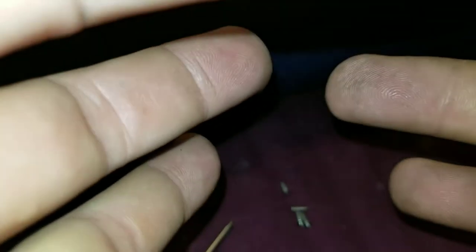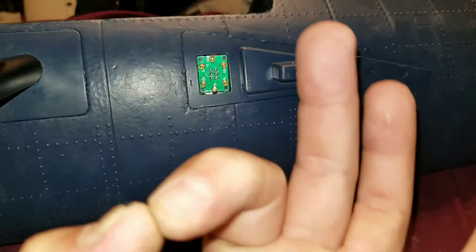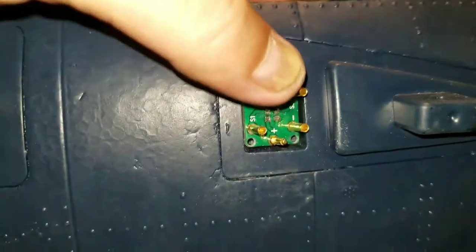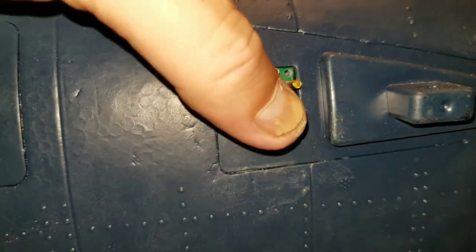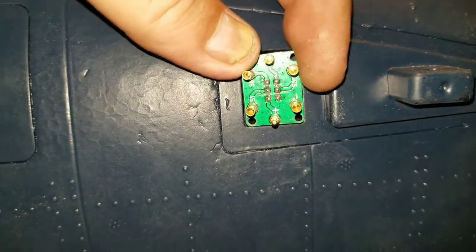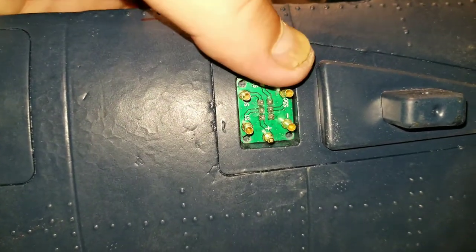You run the risk of breaking one of these pins when you have two boards mated together. If you take two pins and put them together like this, they need to be able to move together like this, and not like this. That's the idea about making this board floating or orbiting. You can see that I sanded down just a little bit — it doesn't take much at all — so that it fits a lot looser in the square hole.